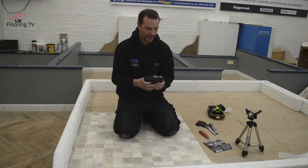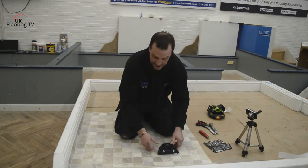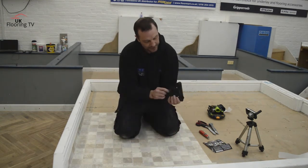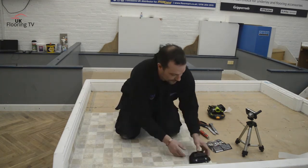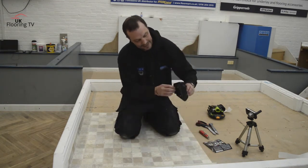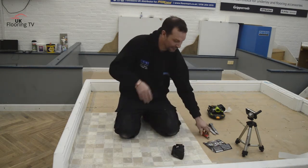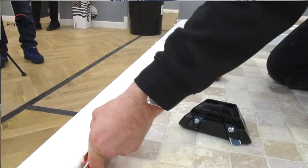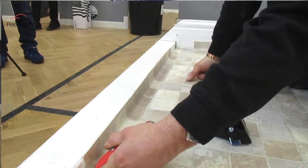It's nice and light and uses blades that are easily available. So, we've set a bit of vinyl up here. I've had a fiddle with it — we've got the heel kicked up a bit to cut in a bit more. You've got the heel up so you cut it short? Yeah. The higher the heel goes, the shorter you're going to cut it. The more you put the heel up, it's like putting your knife up that way, and the more you lower the heel, it's like holding your knife lower.